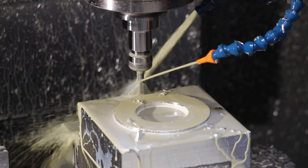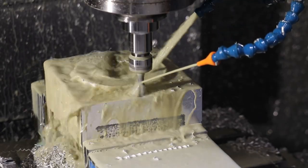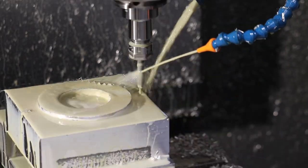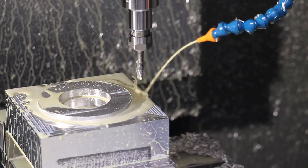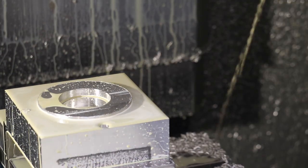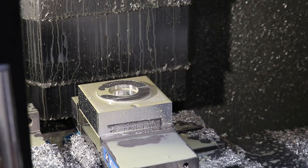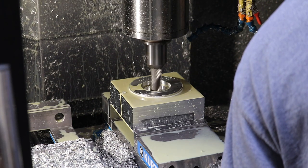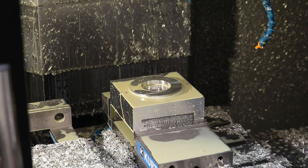Four mounting holes. The A side platen of the molding machine has through holes on this particular machine, so it's easy to mount molds. You just run a bolt through the platen of the molding machine itself into these threaded holes that we're creating. Let's see if I actually showed the 1-inch ball end mill plunging in to create the nozzle. Maybe that's it right there. Oh, there it is. Yeah, so that profile of that 1-inch ball end mill matches the profile of the nozzle